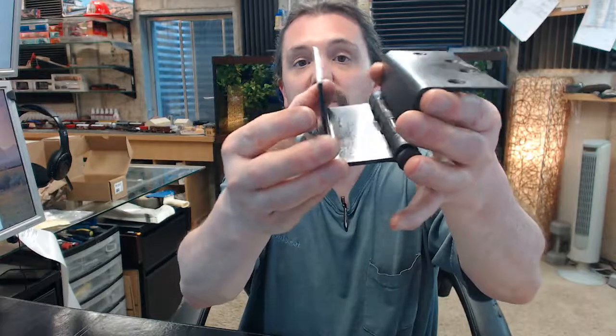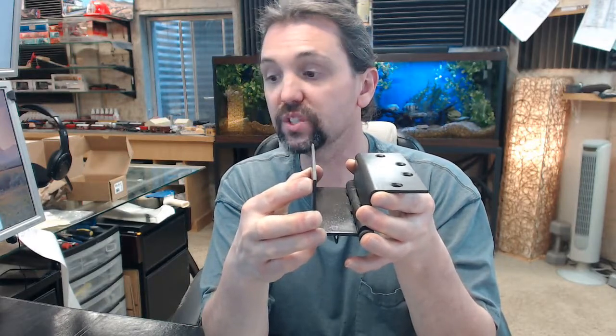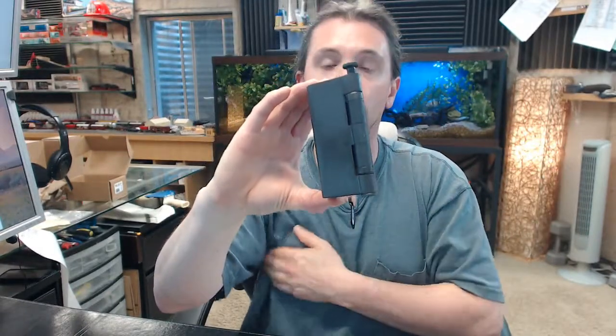It also means that it is standard weight — the thickness of the leaf is 134 thousandths thick on a 4.5 inch hinge. The 20 means Swing Clear and Steel Based: the 2 means Swing Clear and the 0 means Steel Based. The 045 simply means the hinge is 4.5 inches tall. And the 640 means two things: the hinge is made of steel and it is Oil Rubbed Bronze. There is a link below this video to the Cutsheet, where you can review a graphic of what a door looks like hung on Swing Clear hinges from a plan perspective.